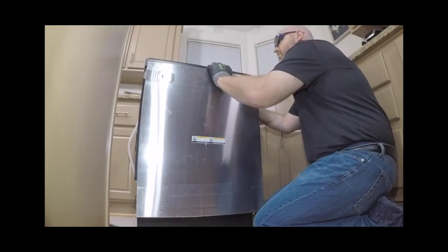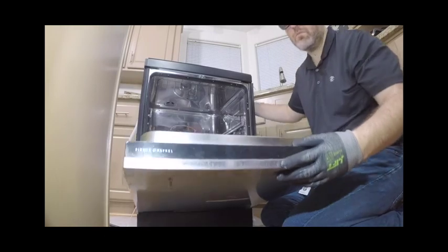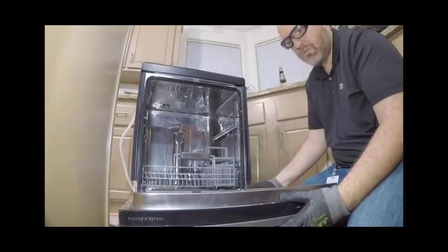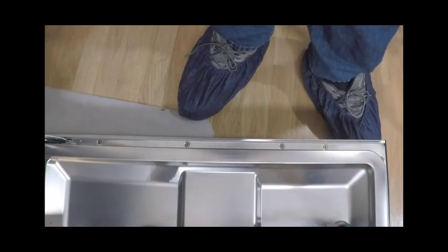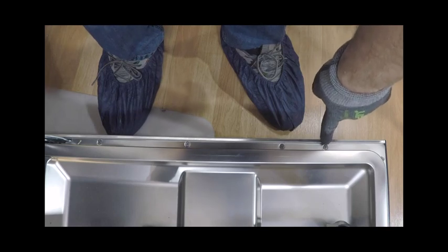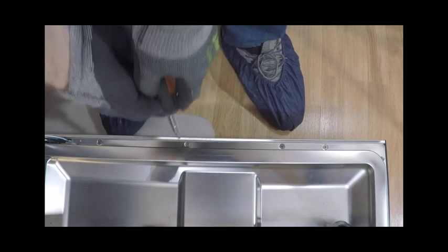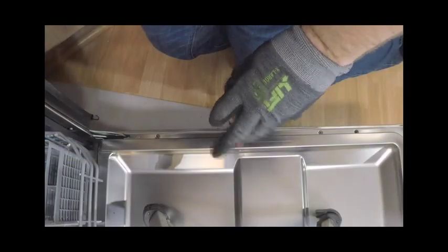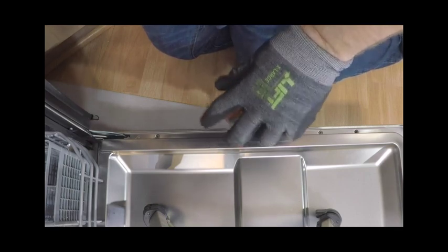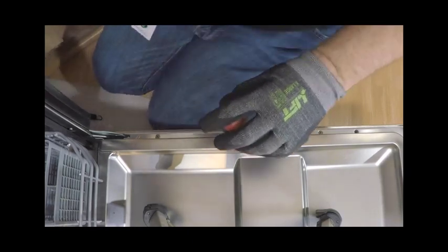The panel can only slide upwards and can be lifted off and reinstalled if required. Checking to make sure that the door panel is properly installed and flush with the control panel, remove four screws — two on each side of the door. Open the door and replace with the 3.9 by 38 millimeter screws to fix the door panel into place, again two on each side.